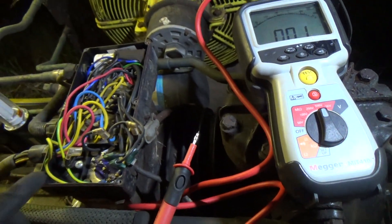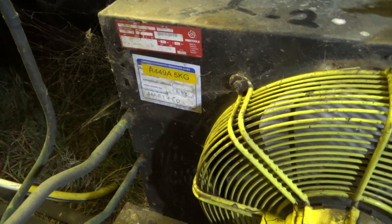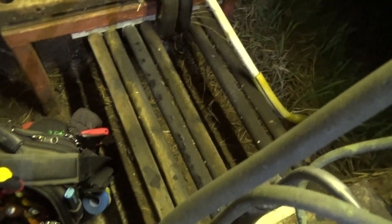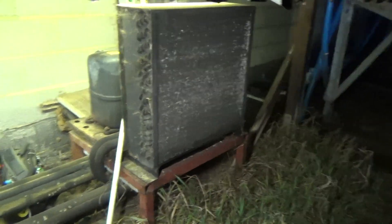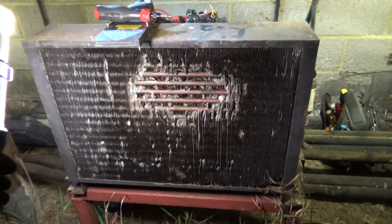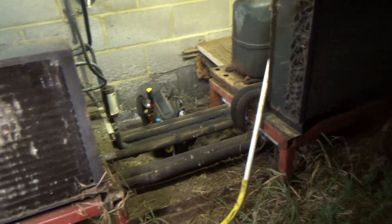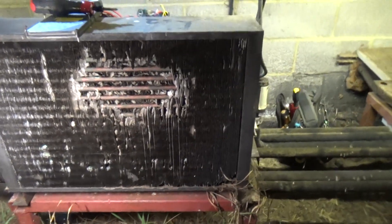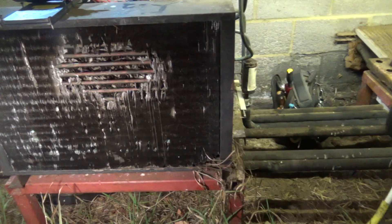So it's time for a new compressor as a minimum. I think this is a two horsepower. But the condenser's rotten on it — the condenser's had it. And it's too small; it should be five horsepower, or probably a four — five if it's a hermetic because they're not as efficient, and probably a four if it was one of these style. Years ago they had two matching ones; one of them failed, and they had this as a second-hand unit kicking about which got put on temporarily — temporary permanent.